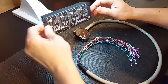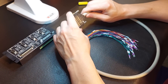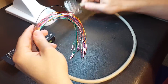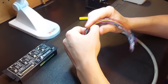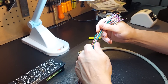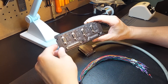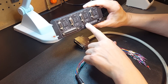Most of the time you're going to be fine with that length. In the event you're not, we can work on different solutions. I don't recommend going past three feet unless absolutely necessary, because this is working as a reverse breakout board — it's not the same as a typical DB25 cable. We want to make sure everything is filtered properly to assure all of your signals. You can see there's about a foot here that is not shielded, and that's fine. You can still put a ferrite on it if you're in a high-noise situation. I would include one if you message me and you're dealing with a plasma system, but under general circumstances with a MASO or similar integrated controller, I cannot emphasize how easy it is to integrate a G540 using this cable.